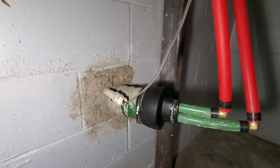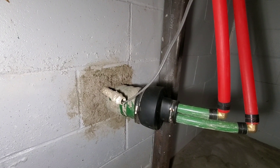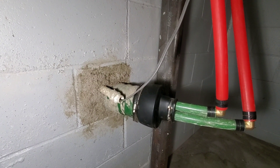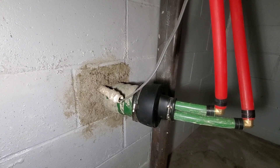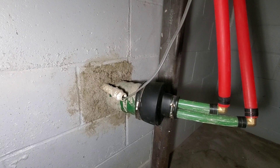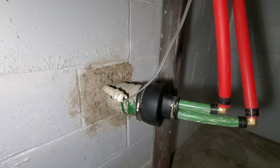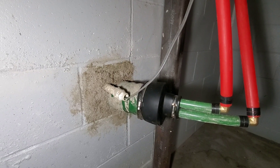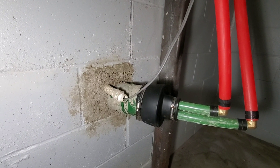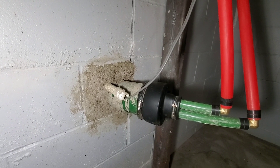That's a 12-2 electrical wire that also runs out there. It basically powers the solenoid on the door, the pump, and the little thermostat and electrical components of the wood boiler. That green jacketed pex is ten and a half bucks a foot from the dealer, so right there was about $650 to $700. But I think in the long term it'll be well worth it, because that's where you would lose a fair amount of heat value or burn a lot more firewood to make up for it if you don't do it right.